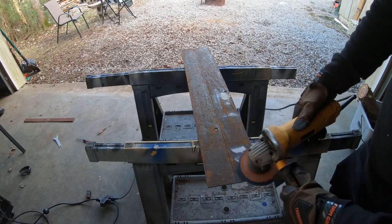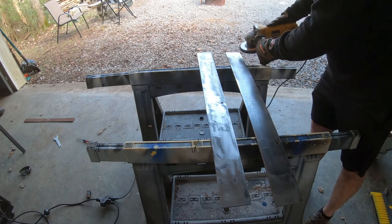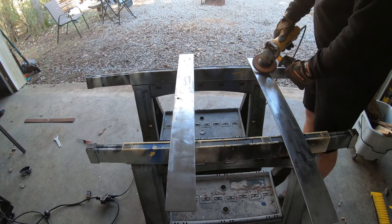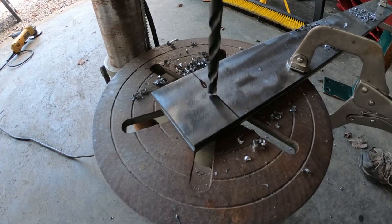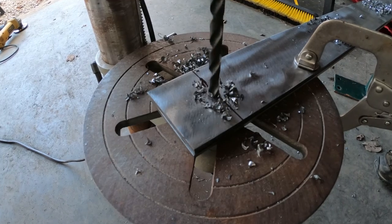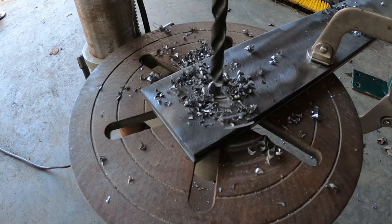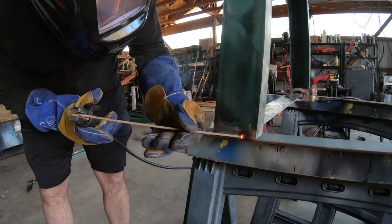I found some scrap flat stock — it was a little rusty, but I knew I could use it to put the bolts in. It wound up being perfect to screw into the bottom of the table through these. I went ahead and drilled some holes based on the position that they would be in the slab. I knew if I just put them at certain increments, they may line up in the middle of a slab, so I was pretty cautious about this. Also, I knew I was going to have to elongate these holes so the slabs would have a chance to expand and contract.